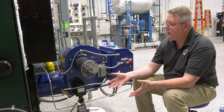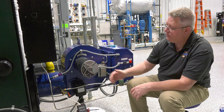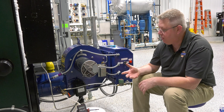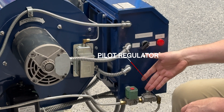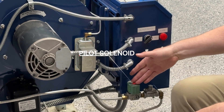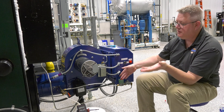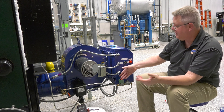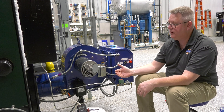When we're setting up our pilot, we do want to make sure that we've got the right gas pressure — and that we've got gas pressure at all. The tools we use to provide that are a pilot regulator and a pilot solenoid. The pilot solenoid is going to energize at the moment of ignition, and our regulator is going to ensure that we have the correct pressure to the pilot.